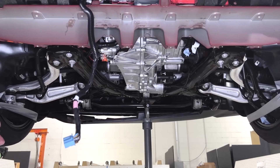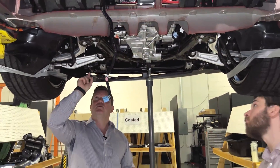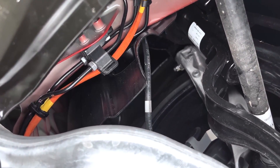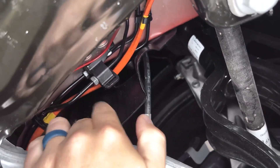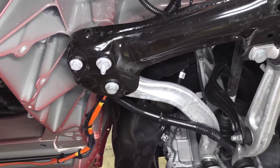Tesla is really living up to this mantra, deleting parts and processes left, right and center. Anyone in the automotive industry could have done what Tesla is doing in terms of automotive manufacturing — the huge castings — but they didn't. They got complacent and comfortable, too scared to rock the boat. Any renegade engineer who proposed such a crazy idea on how the company could save huge amounts of money and gain an advantage over the competition was told to shut up and keep doing what they've always done. The level of refinement and integration is incredible and Tesla is not wasting any opportunity to integrate the casting for multiple mounting features. Even this small little fin of aluminum with two rivnuts and two bolts is holding a bracket for the high voltage line for the AC compressor as well as a thermal tube.